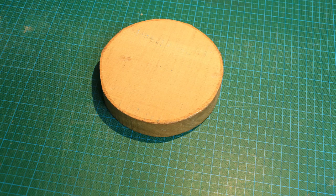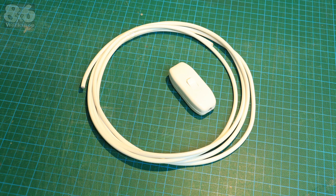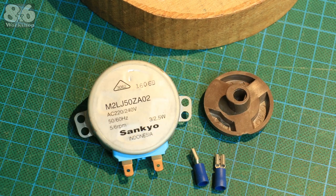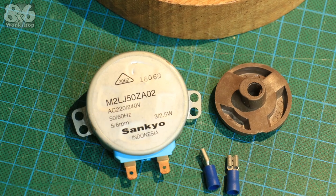The body will be made from a 150 by 25mm oak blank, a couple of meters of two core cable, an inline double pole switch, plug, and a 3 amp fuse to replace the 13 amp fuse that comes as standard with the plug. I'm using a microwave turntable motor with a rotational speed of 5 to 6 RPM. There's more build information and product details in the description.